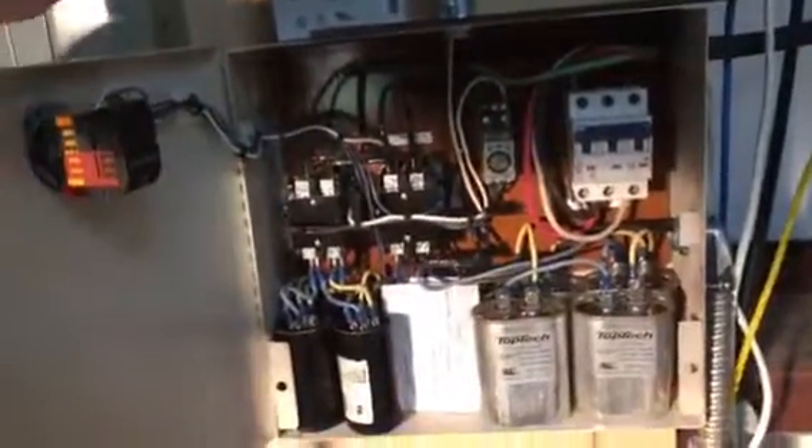The good thing I like about this design with the coil disconnects is: if you've got this thing running and the power goes out, when the power comes back on, my machine stays in the off position. I like that aspect — we're basically simulating a power outage here. If the power comes back on, my machine stays off.